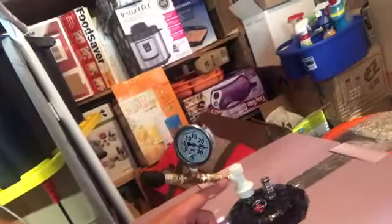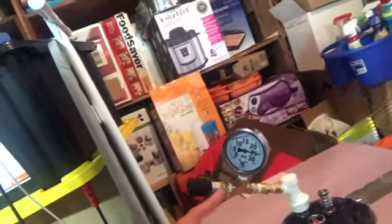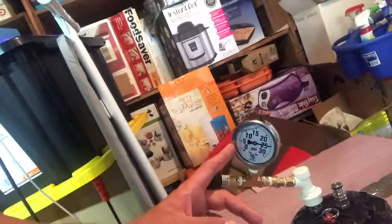There was a brass spunding valve on here for an extra $20 to $30. I took all the brass fittings that were on here, put a new spunding valve — a pressure relief valve — and I have a liquid-filled PSI gauge. It's pretty much exact. I filled off my CO2 tank; it was at 25 PSI, two bars, and it works great. The other one was completely off. You know, you can make one so much cheaper.